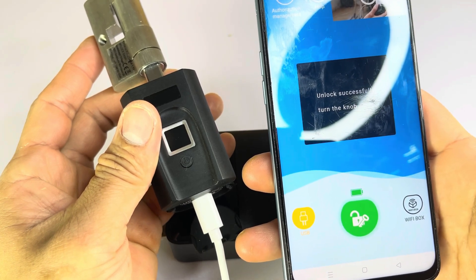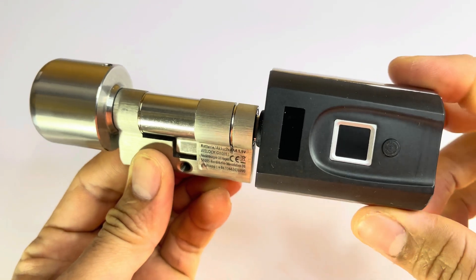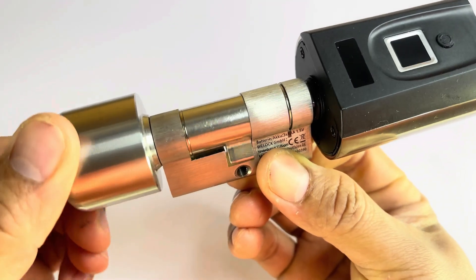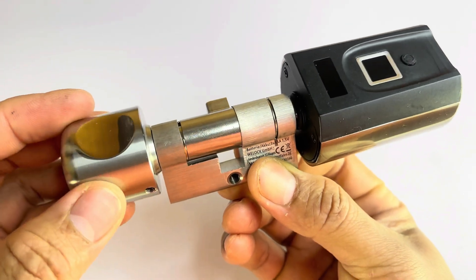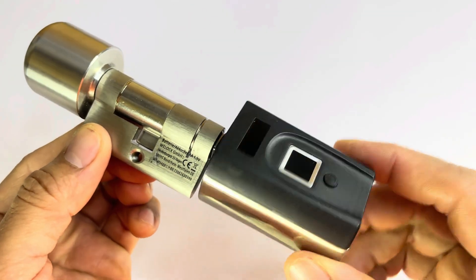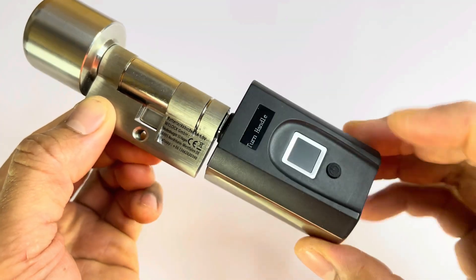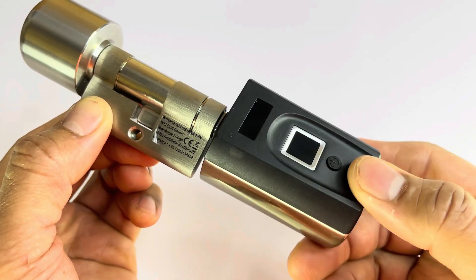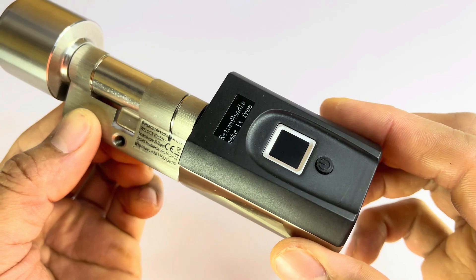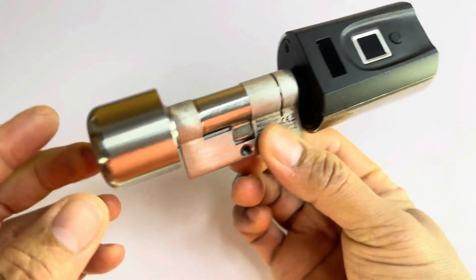So how was that? Isn't it cool? The rear doorknob is lock-free, so even if it is locked on the front doorknob, you can still open it from the inside. If the fingerprint knob can be rotated smoothly, it means it is in standby mode — neither locked nor unlocked. Locking the door is the same as turning the key manually: press the wake-up button, tap your user or admin fingerprint, then rotate the knob until it locks the door. Unlocking takes 5 to 14 seconds and it will automatically lock after; the fingerprint knob must be rotated within that window to unlock. Always double-check using the main doorknob to confirm it works.